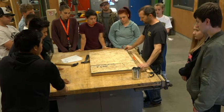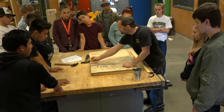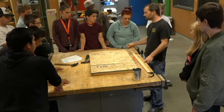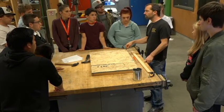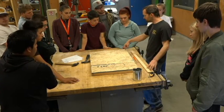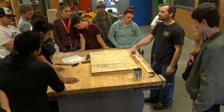A common mistake is everybody likes to go right to the corners and put a nail in there — why is that a problem? Because it's going to split. There's a nail directly under the corner, and if you nail right on top going down to where that nail is, it's going to splinter and break. So we don't want to nail directly above an existing nail. The cool thing is we can see from the side exactly where the nails are, so we know right where we should not nail.